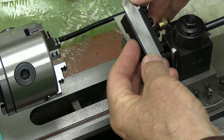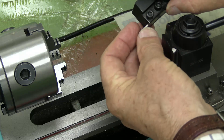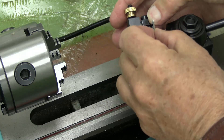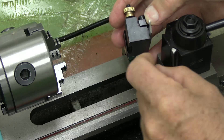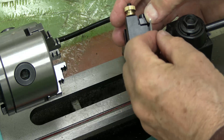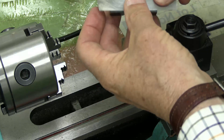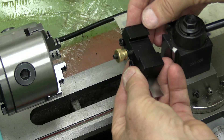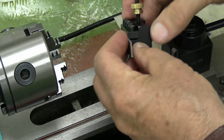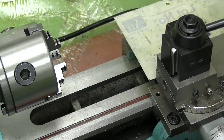This one works quite well because it's extremely narrow, even though it has no taper here. So there's no clearance, and I dare not grind any more off this, otherwise it might break. But it works quite well. So my project today is to make an equivalent of this tool holder that will fit on this dovetail.